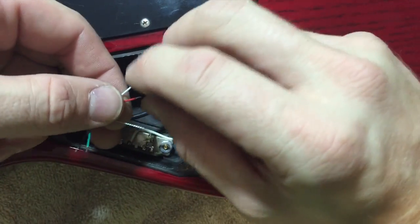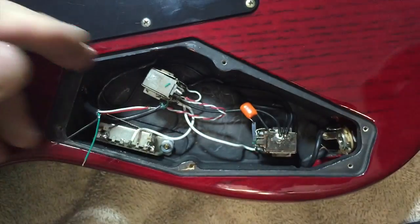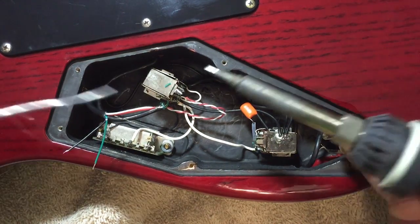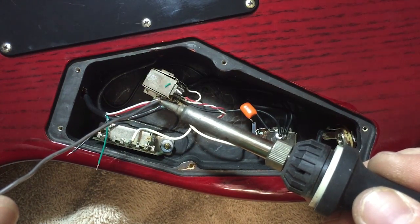The red and white wires get connected together right off the bat — just twist those together a little bit. Get your soldering iron, clean it off, put a little bit of solder underneath the wires, and then apply solder to the top.